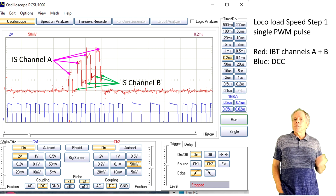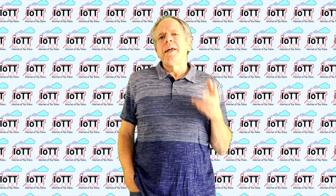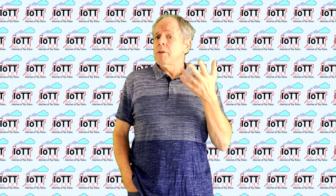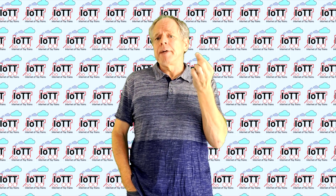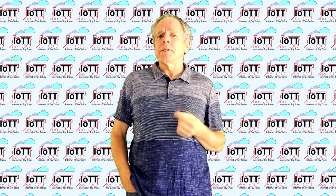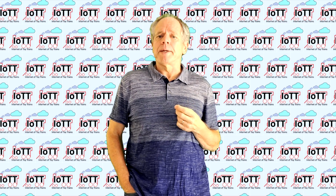With such a difference between the two sides of the DCC signal, a meaningful current measurement as discussed in video number 104 is basically impossible. And while thinking about what I saw in these curves, it dawned on me that this difference of analog voltage between the two sensor outputs is probably the very reason why there are so many people reporting difficulties when trying to use the IBT-2 for service mode programming.